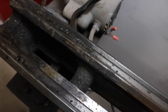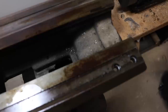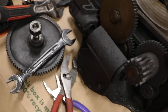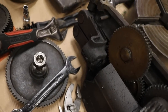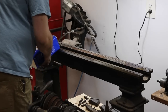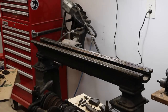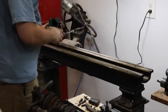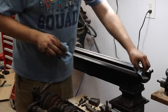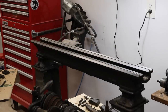After taking one bolt out after another and removing all the major components, you could really see both how much dirt and rust were on the lathe, but also how great a lot of the surfaces really were underneath. None of the rust went very deep, there was really no pitting to speak of, and there was a lot of dirt that can luckily be taken care of with some mineral spirits and elbow grease. The bulk of this project was really just a lot of scrubbing with mineral spirits, Brillo pads, steel wool, and brushes.